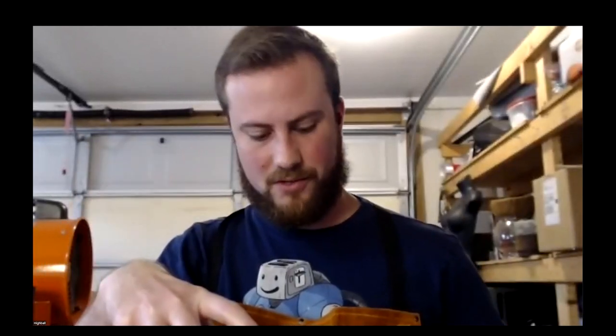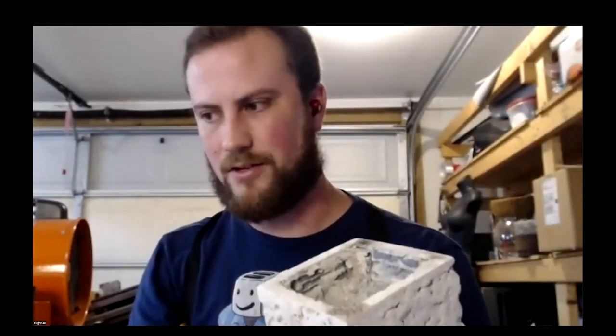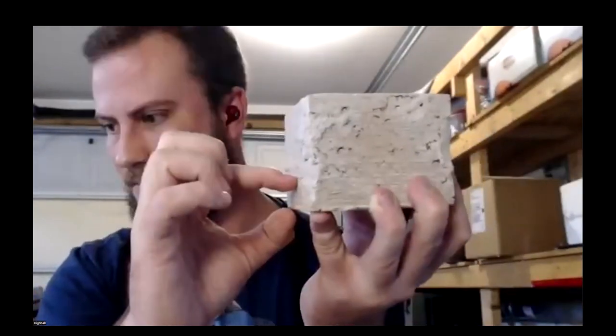I would get my crucible, and this particular type has the elements in the walls, so there's no additional step. I would essentially just pack this with ballast, which is from a previous sinter and debind, so there's still some ballast in there. I didn't quite clean it out, but I packed it with enough layer of ballast so that the part would be supported, and I would give it a good shake. I'd fill up about this much from the bottom so that I could first load the part.